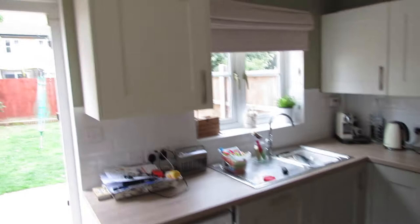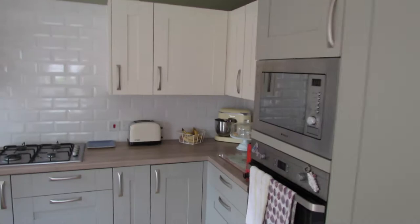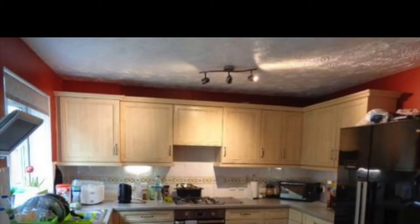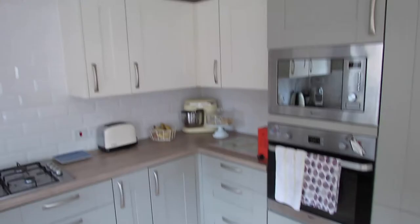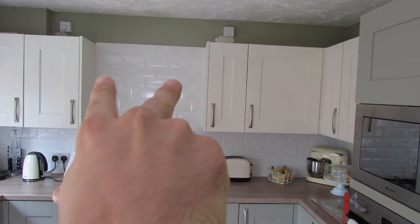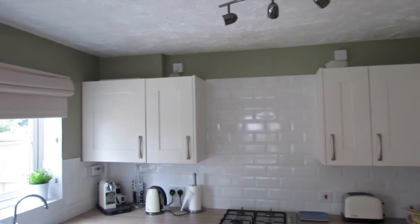Let's go. So this is the kitchen that I've built so far. Cabinets, still bits to finish off. But I will put a picture up of the old kitchen right now. But to be fair, not a bad job for the first kitchen I've built. So this is the flyover that I'm going to try and build today. Because then the extractor fan's going to go there. Just a recirculating one. Because we can't vent it out there because the gas pipe would be right next to it and it would come back in and we'd all die of poisoning. Let's crack on.